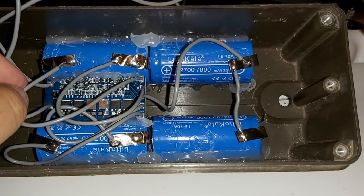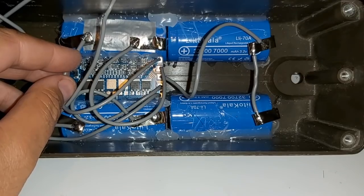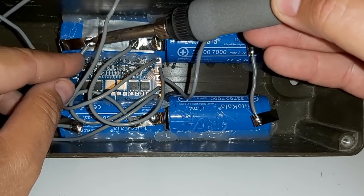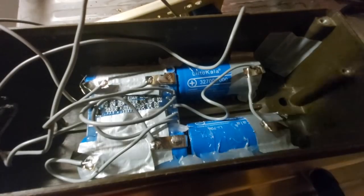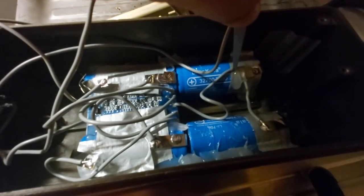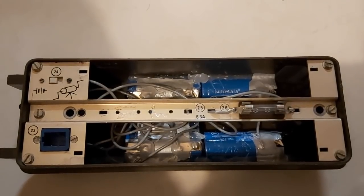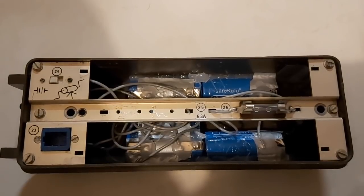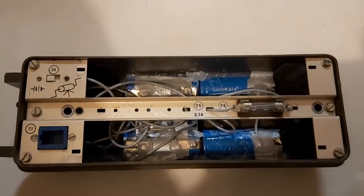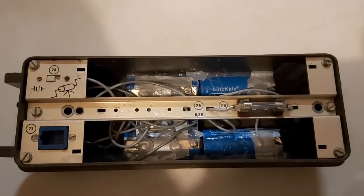The wire touched the body of the cell — apparently the insulation is very thin, so I put some duct tape there and I'll check the other cells and put duct tape under them as well. It's basically finished and I checked — it works. I'm going to hot glue the tabs to make sure they don't move. That's the danger with these batteries: you want to absolutely make sure there are no shorts anywhere — they could set your house on fire. I put a spare fuse inside the case and it's ready to go.